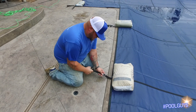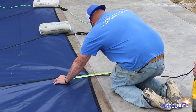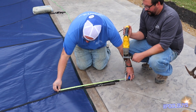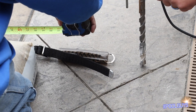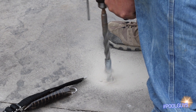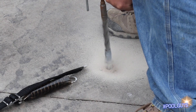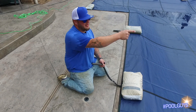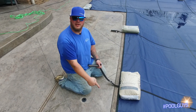When you're doing this, it's kind of important that each one of these all the way around the pool are the same length. That way when we go out and measure out and start drilling our holes for our anchors to put in the concrete, each spring pulls the exact same amount of cover towards each anchor. That way you don't have 10 inches of cover over there and no inches of cover over here.